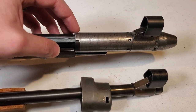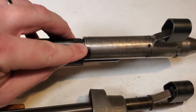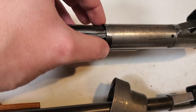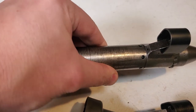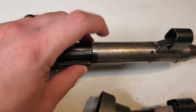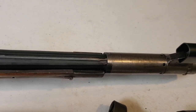This gas system is just crazy — it's nuts that this was considered a good idea at all. The front sight and this whole piece here is just one solid unit, and the only thing that keeps it in place and lined up is the way the little top extends out between these two pieces, which are actually extensions off the barrel. If you wiggle it, it just has the very slightest give to it, and that is connected to your front sight. So there's really not a good idea that there's that much play. I can't imagine these guns would be accurate after so many years and wear and tear.